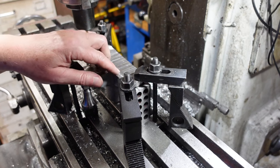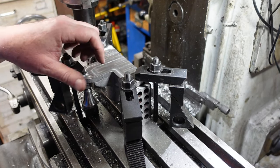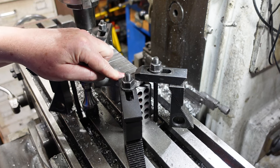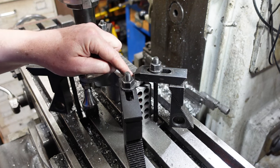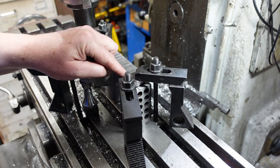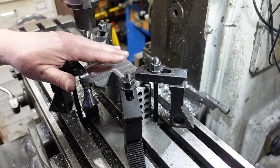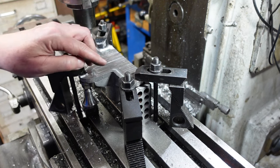I'm about to swap clamps over here. A couple of points worth noting: firstly, if you're going to do this sort of thing, put your new clamp in before you remove your old clamp. That's holding it down quite nicely - I've put this clamp in here and that'll continue to hold it so I can take the other one off. Fingers crossed it's at the same height, because if I took the clamp off due to unevenness in this setup, when I clamp it back down it might move slightly.